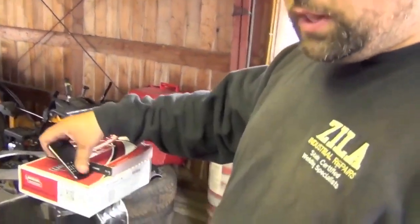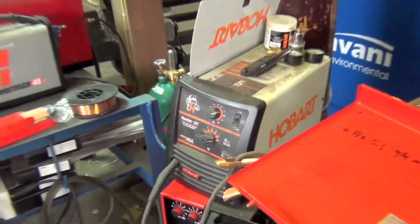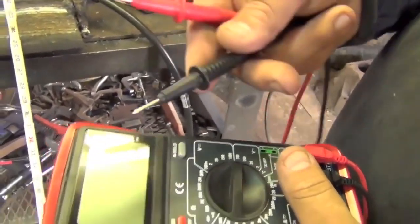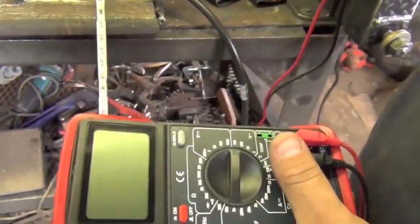Next up, let's talk about voltage. Every welding machine has voltage settings. If the voltage setting cannot be displayed digitally, you can always measure it with a voltmeter. The way you do this is you tie the two probes into the positive and the negative — into the ground clamp or the gun, or any screw where the hot wire for the gun is attached. Like the polarity terminals.